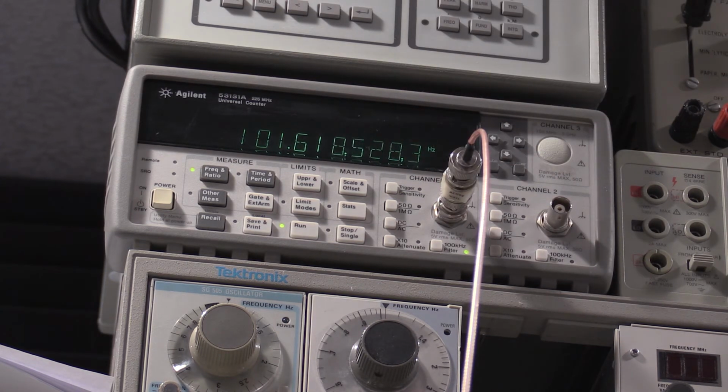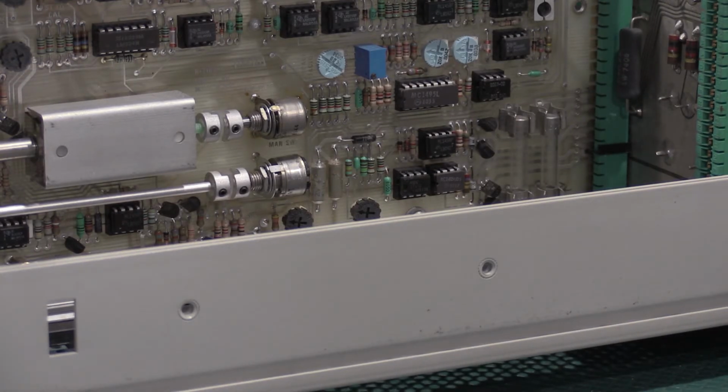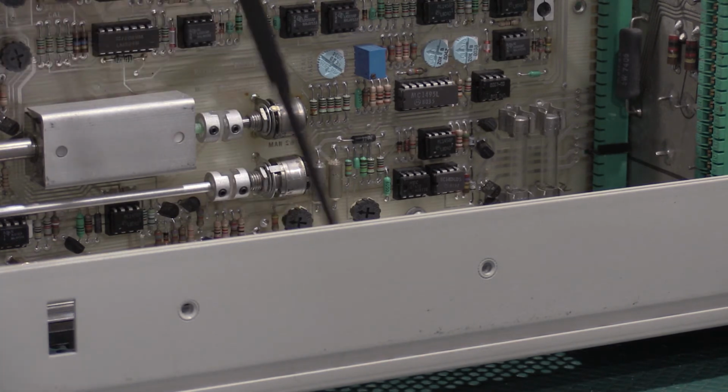1546 is all the way on the bottom of the sweep main board. So I actually need to move the plug-in to the other side because I have to get at that control. Well, it wants exactly 10.00, so we have got an additional zero, so that's going to be good for that one. Just so you guys can see what I moved over, this is the adjustment right here that we just did. It would have been too close to this rail, so I kicked it over to the other one.